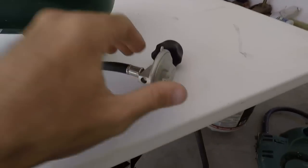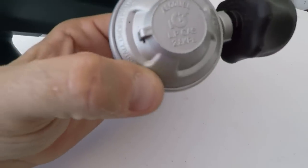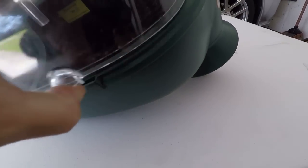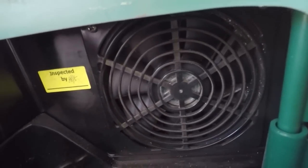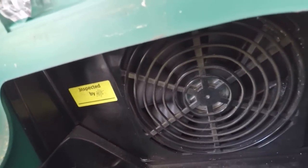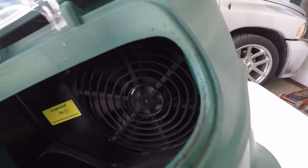I know there's a typical barbecue-style gas inlet, this is a regulator, but I think it's also a high-flow trip so it's possible something is going on in there which we'll have to check. The only other thing I'm aware of is you can see the fan in there - it's just a regular computer fan. I know it runs because when you turn it on you can hear it spool up. That's what draws the bugs in. There's some crud built up over time on the inlet.